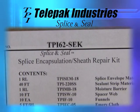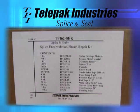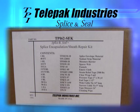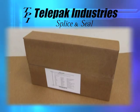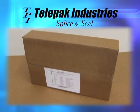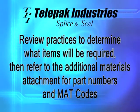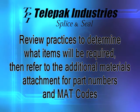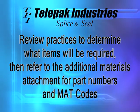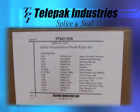The bulk starter kit, called the TPI 62 kit, contains the basic materials required to install force encapsulated splices and all types of sheath repair. But due to the wide range of cable diameters, cable types, and severity of sheath damages, additional splice and seal materials will be required. Review practices to determine what items will be required, then refer to the additional material attachment for part numbers and MAC codes.